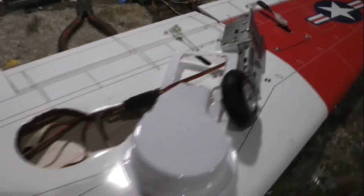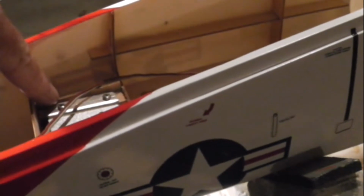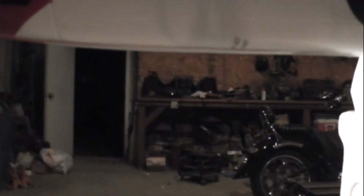And you see I've still got this one to go. There's the forward gear installed. You'll notice the slight angle or the forward rake. There's a shim under here, so this end is higher than this end, which slightly pitches the gear forward. You can hardly tell at all looking at it, but it is. It's slightly pitched forward, and it just allows the wheels to clear the wheel well. Just perfect, so that the doors will be able to close and not hit that elbow.